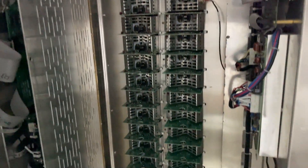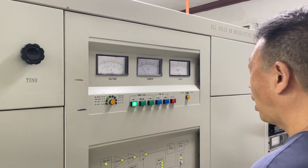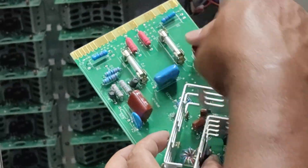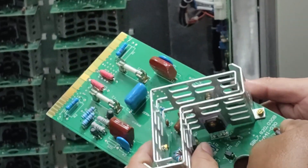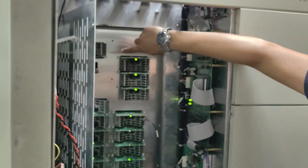Component number 10: the power amplifier. The final component is the transmitter power amplifier module. The amplifier module amplifies the low-power audio signals from the modulator to a high-power RF signal for transmission. It consists of driver stages, power amplifier stages, and output matching networks working together to boost the signal's power while maintaining signal fidelity. The amplifier module is crucial for achieving the desired coverage and signal strength in the AM transmission. The total output power of the transmitter is the combined output of multiple power amplifiers.